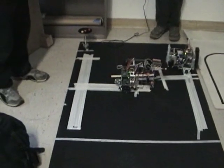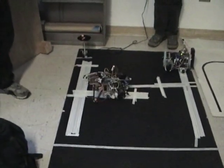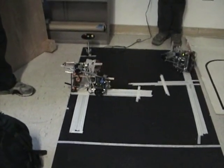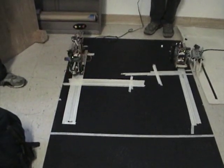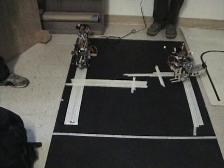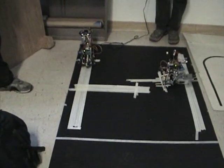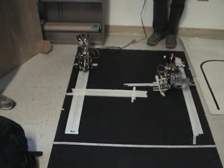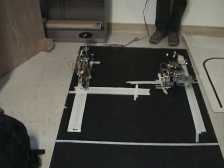A lot of weight on that one. We did run into a slight weight problem. We were going to use a digital encoder, but we think it was because of the added weight and the distance of that weight out from the center that the digital encoder just had a hard time — it could not go fast enough to calibrate itself. And also, when it did calibrate itself, it had erratic data. It didn't work too well.